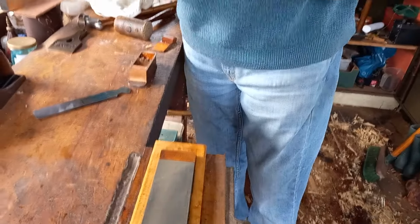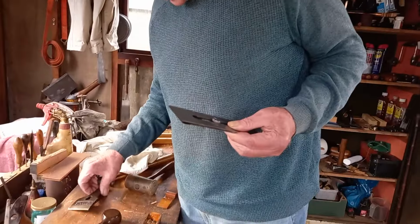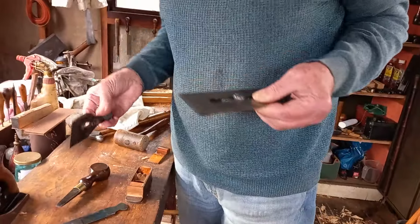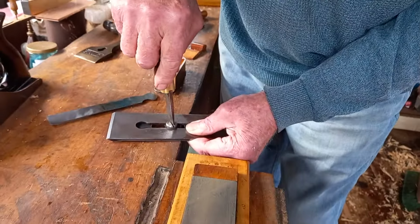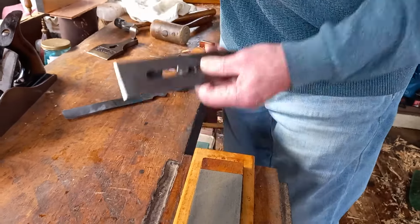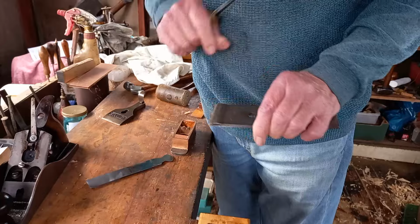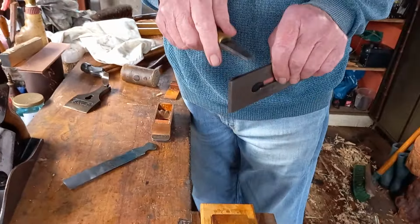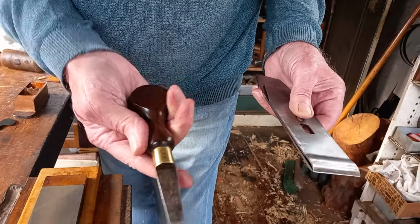Turn it over. Now this is the proper screwdriver for the job. You shouldn't use that. You can break these in time, take chips out of them. Everybody does, but you shouldn't. Place it on there, tighten it up really tight. Check to see that this is flat, and that's another thing. It just makes sure that they're tightened up parallel. You see the little marks on there, look, where over the years it's been caught slightly on the edge of something, but if you use the proper screwdriver, that's what it's made for.